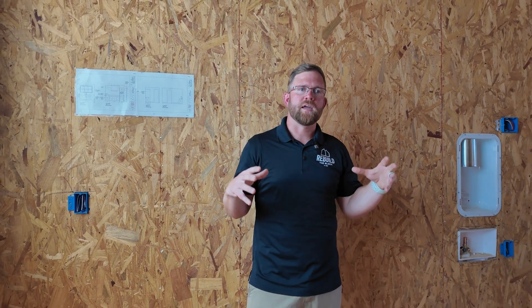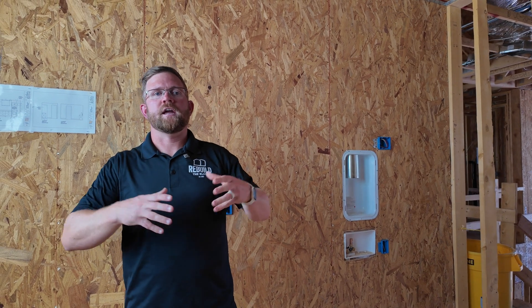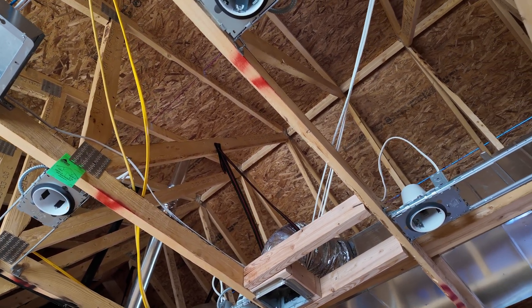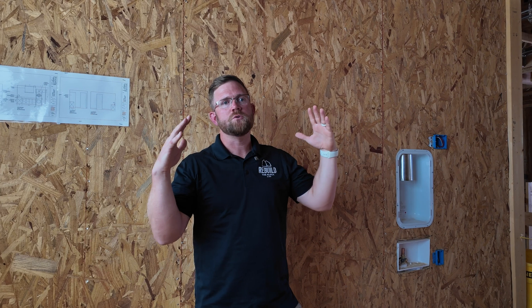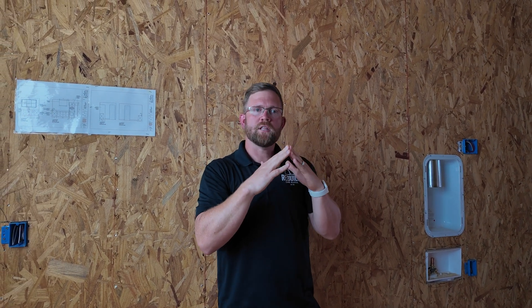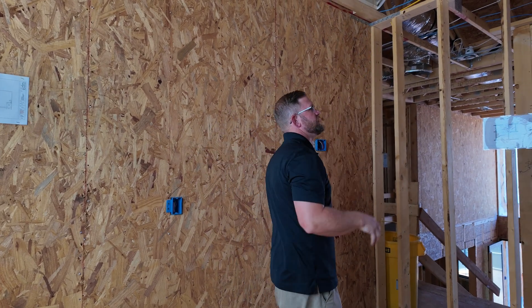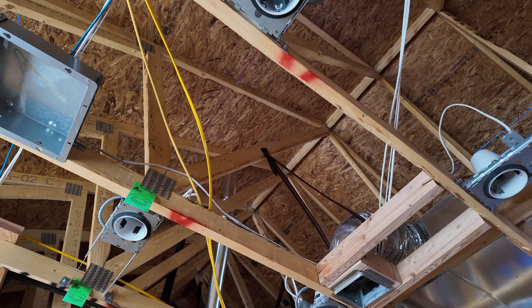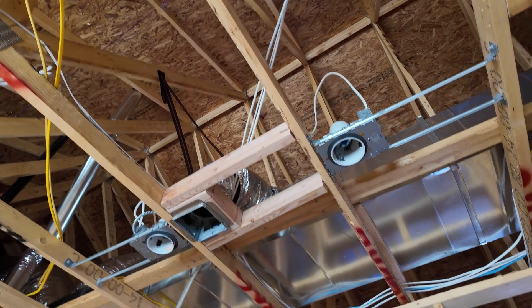Let's move on to a few other types of trusses throughout this home. We have a very modern and linear look, so we have a gable running front to back as well as one that creates an L-shape running east to west. In this case we have the largest span upstairs, and we're able to get a fan truss in place, which allows us to span a larger distance between our top plates. Instead of a king post, it fans out — with two additional scissor truss members reaching the ridge line — and provides a ton of attic space that's necessary for our laundry and mechanical room, where our main trunk lines and air returns service the rest of the home.